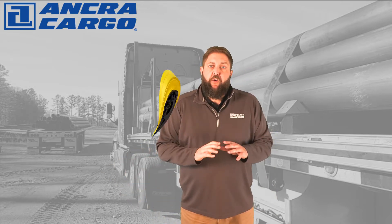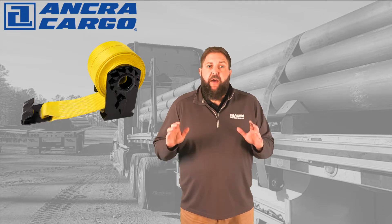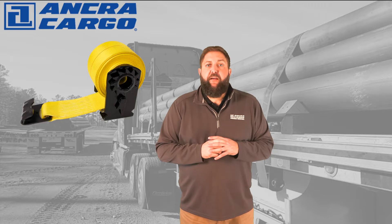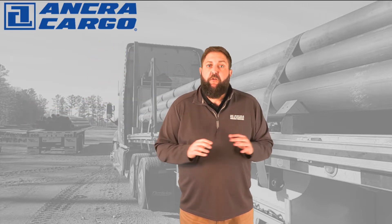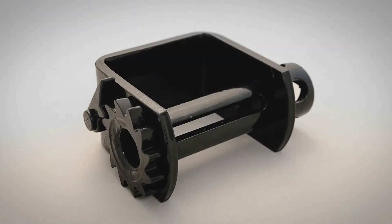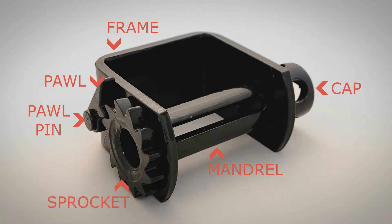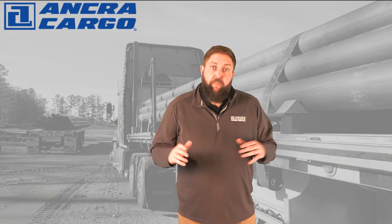Web winches are used to secure cargo or equipment to flatbed style trailers and delivery trucks. They essentially act as a mounted ratchet and typically utilize four-inch webbing with various end fittings, although two and three inch winches are also available. While the shape and size may vary between models, all winches have six basic components: the frame, the mandrel, the cap, the sprocket, the pawl, and the pawl pin. The sprocket, the pawl, and the pawl pin combine to make a one-way motion device that maintains tension in the mandrel.